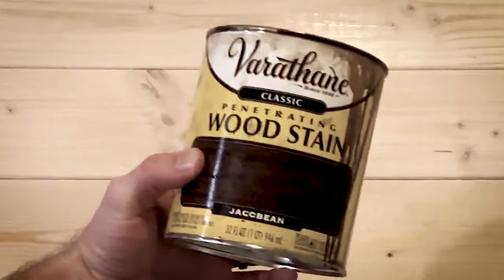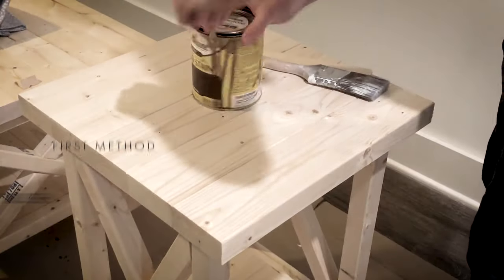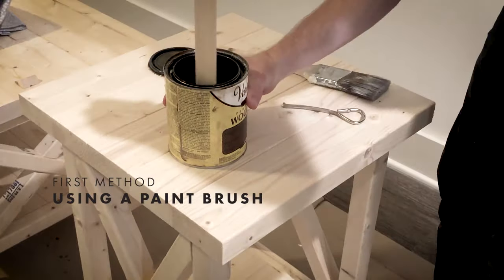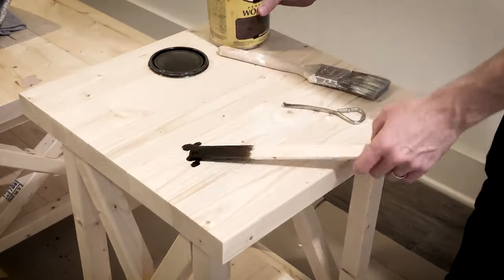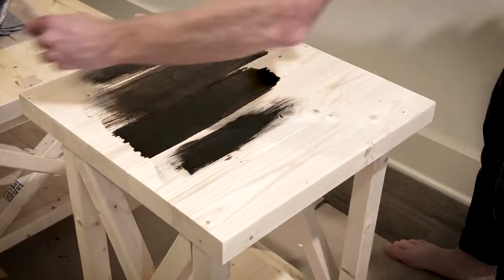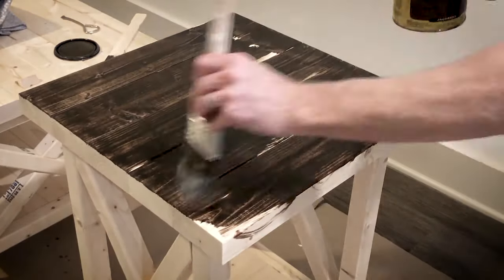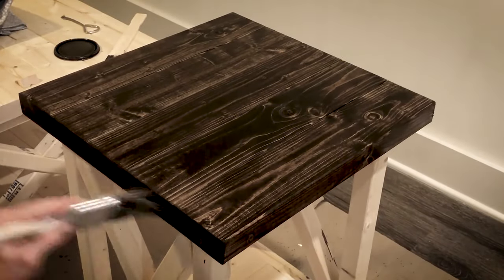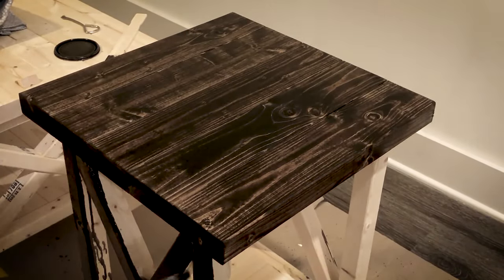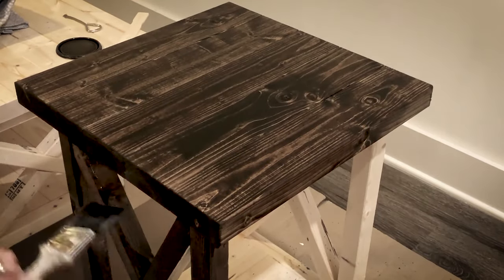Using a classic wood interior stain, place your base coat onto your piece. Stain works well as a base because it does a great job of soaking into the wood to provide a proper underlying coat. It's important to place a thick generous coat that completely covers the entire piece. Focus on thoroughly covering exterior corners, any indents in the surface, and where knots occur in the wood grain.